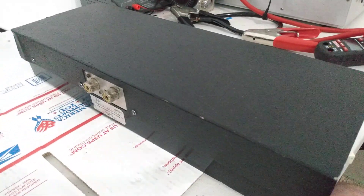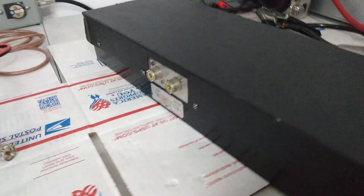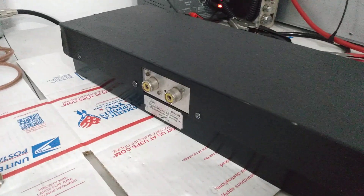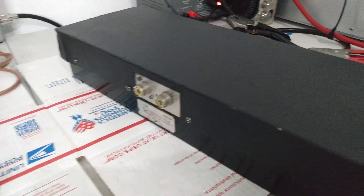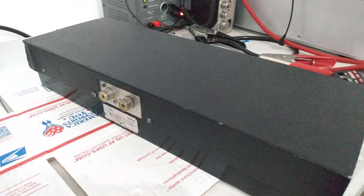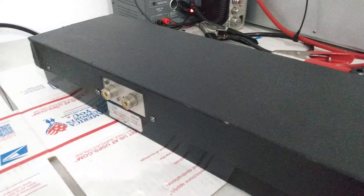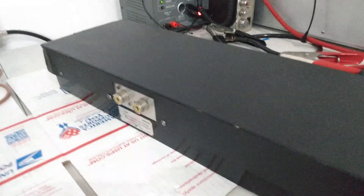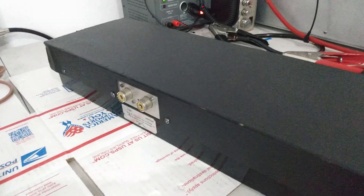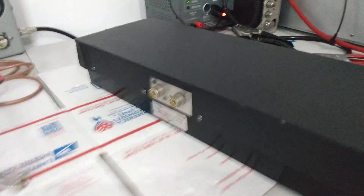I may have killed it running a little too much dead key. I was putting about two and a half watts dead key into it and it was dead-keying about 100 watts, which I thought would probably be safe. But I may have killed it myself. Honestly, I think what killed it is the biasing in the amp, because it was acting kind of funny. I was actually getting ready to do a video on it and I'm like, I better mess with this thing for a minute and make sure it's stable before I put it up for sale. I was noticing on the clamp meter that even with the 100-watt dead key, this thing was drawing a ton of power — like 70-something amps — and then when I talked in the mic, it would go up to drawing like 80. It shouldn't have been drawing 70 amps with a 100-watt dead key, and I'm pretty sure that's what got it.